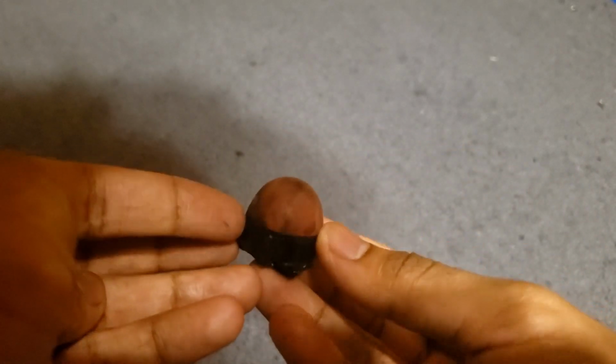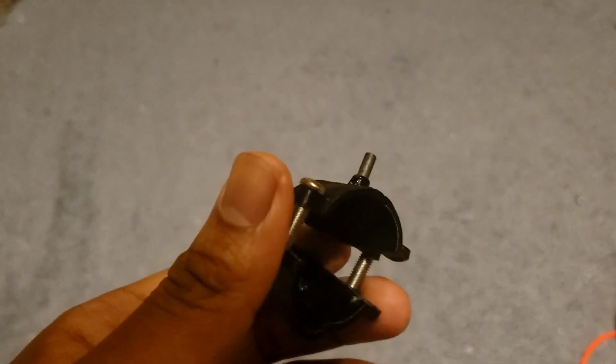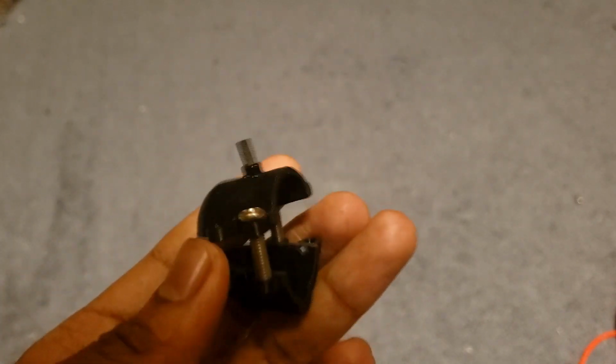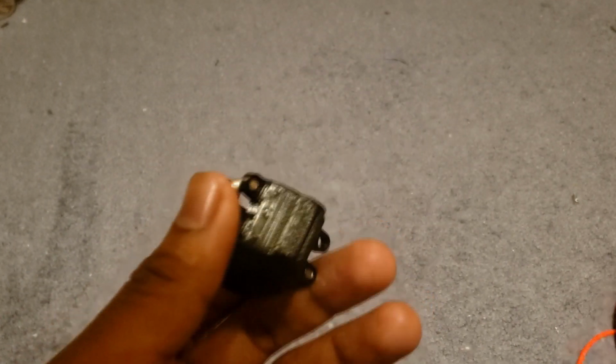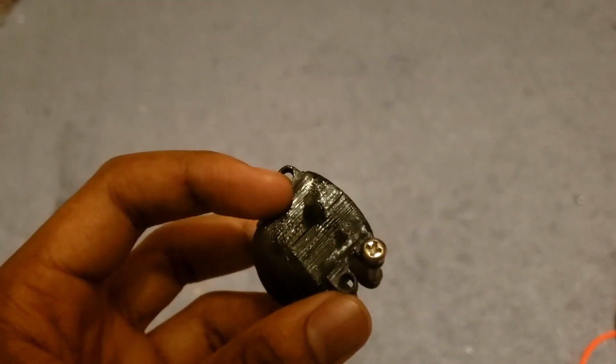I cut the fingertips from the insulating gloves and placed them on the grounded chainmail glove. I then 3D printed a holder for a graphite electrode that would serve as a breakout point for the arc. So the insulating glove would serve as a resistor, not allowing the arc to go to ground, and the arc would be forced to jump an air gap to get to ground. And that's how it worked. The arc jumped through the air and onto the grounded glove.